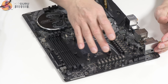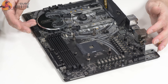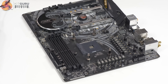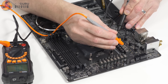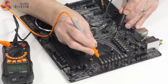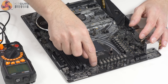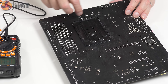Here we have a puzzle: the 16 power phases, which are Texas Instruments power phases. ASRock's spec says 16 power phases. Typically there'd be 14 for the V-core and 2 for the SOC, or conceivably 12 for the V-core and 4 for the SOC. So I grabbed a multimeter in continuity mode to test the connections — which actually suggests that all 16 power phases are working in unison, meaning all 16 for the V-core, which would be just weird. That is the VRM controller right there, and over here is the power regulation for the memory as a wholly separate thing. Flipping the board, we can clearly see there's a doubling scheme — eight components — so logically that's controlling the 16 VRMs as eight pairs.